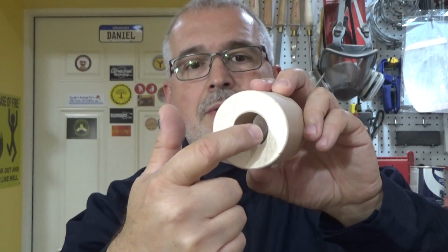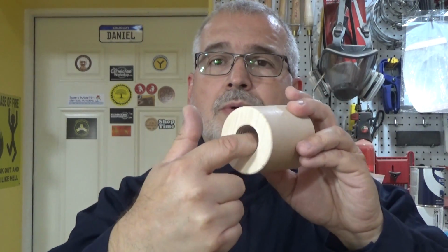And one thing that some turners do is to put some paste wax in the threads to protect them a little bit and also to lubricate them. And also some turners use CA glue to strengthen the threads, because in the case of my lathe it is a big pitch, 8 TPI, and they are big threads. I don't think it's necessary, particularly with a hardwood like the maple. But for smaller threads, maybe it may be a good idea to put some CA glue and then re-thread it.